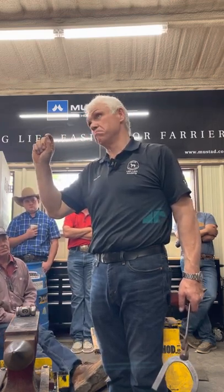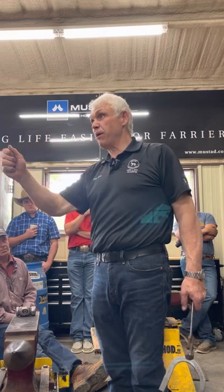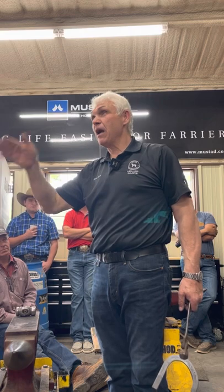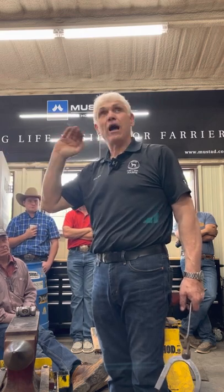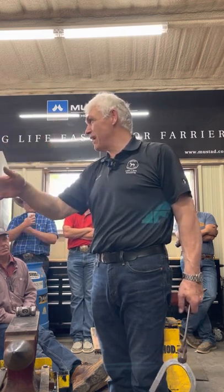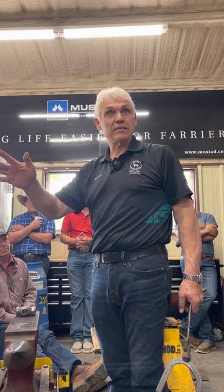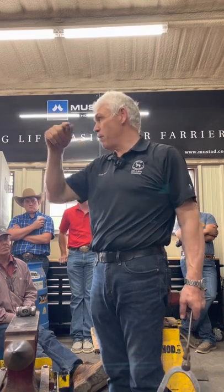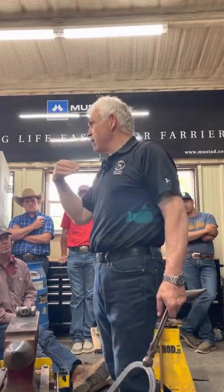I mark it. I orientate the punch, make sure it's in line with the shoe. I stamp to 60%. I work the outside edge. I work the garniture. I flatten the hoof side. I flatten the ground side. And stamp to 100%. The first stamping is to compensate for the fuller. Now I'm going to stamp to 100%. I level it. What's next? I stamp to the anvil. I pritchel it. I level it. I pritchel.